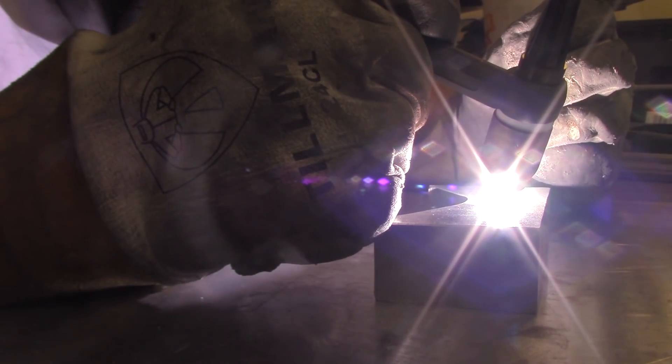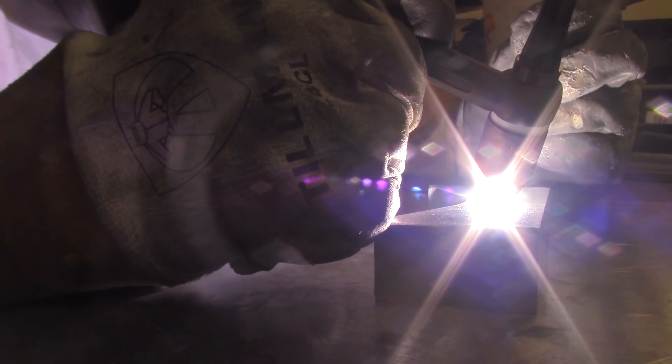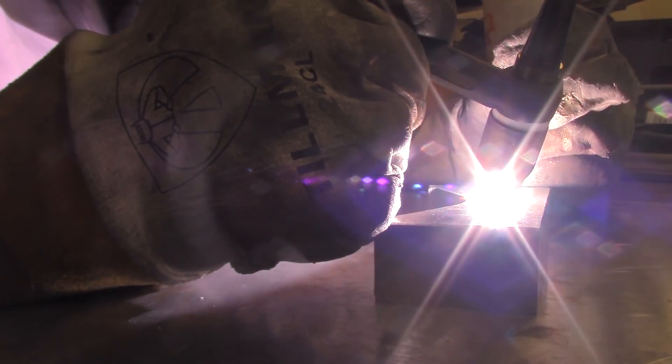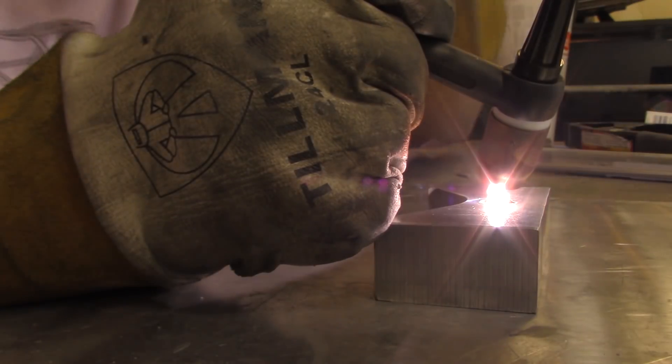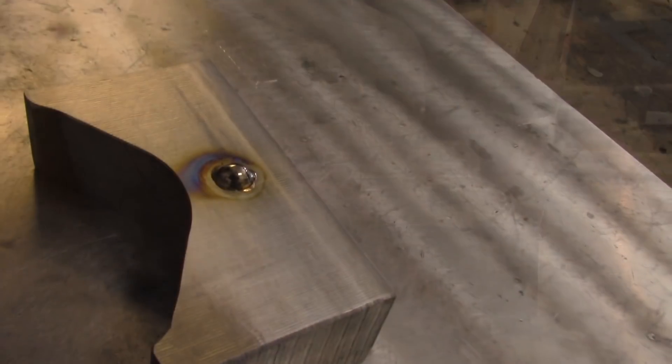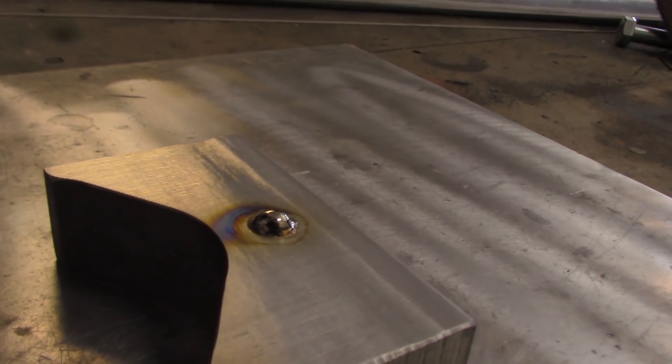Titanium specifically, when it is liquid hot, it is over 3000 degrees Fahrenheit. So 3000 degree Fahrenheit liquid hot metal combined with gravity means if you get it too hot and too wet, if you will, it is going to fall out, it is going to burn through everything until it solidifies. And titanium stays hot a lot longer than many other metals because it is not thermally conductive. So either way, just something to keep in mind — that is why it is really good practice here.